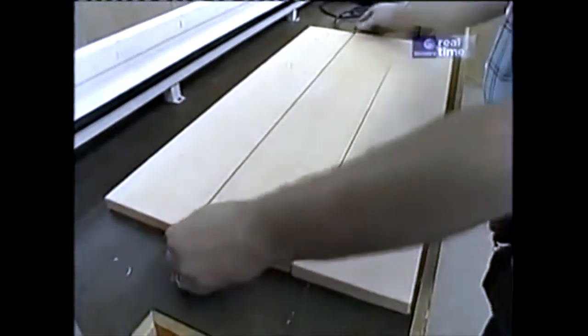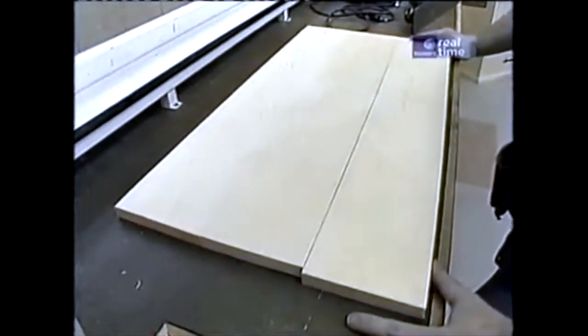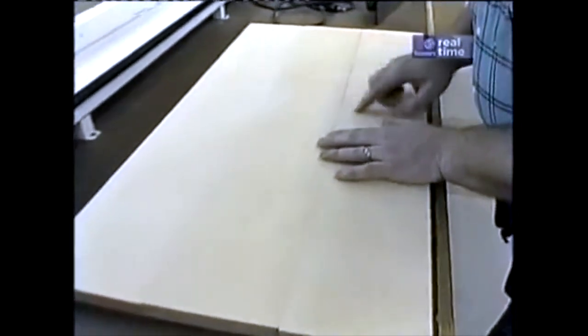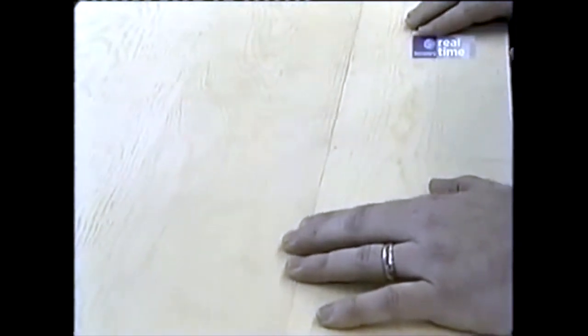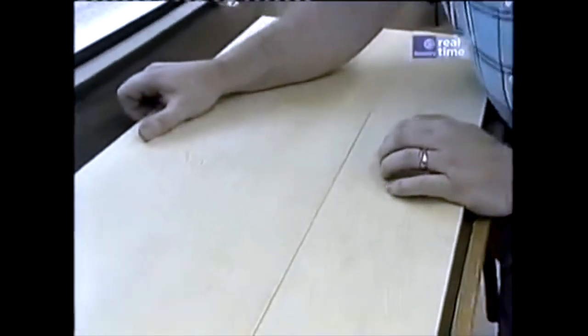It'll tend not to curl as much as having them all in the same direction. Now before you can actually glue the boards up, you want to check the joints. And here there is a little space, they're not pulled tightly together. I could fit a playing card in there. I want the boards to fit together without any force. They should dry fit with no space so that when I glue them up, I don't have to force them